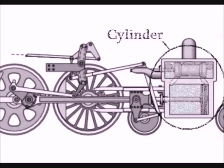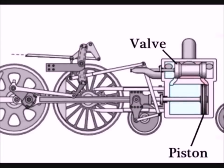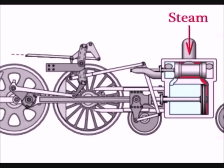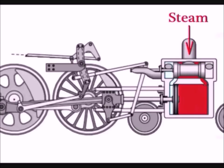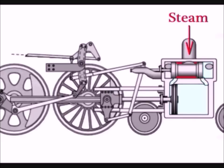Each cylinder has two chambers. The top chamber contains the valve and the bottom chamber contains the piston. The valve slides forward and backward, allowing steam from the large pipe on top to enter into the bottom chamber either in the front or the back of the piston. Let's open up the throttle and see what happens. The valve allows steam to enter into the front of the piston, pushing it back. The piston drives the connecting rod backwards and the wheels turn halfway around. At this point the steam is used up, and the valve moves to allow fresh steam to enter in behind the piston. The escaping steam is what makes the chugging sound.